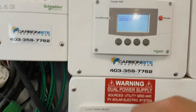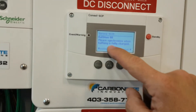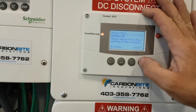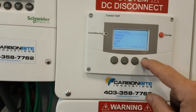The battery monitor is saying at the bottom 'synchronize now.' I can't synchronize it right now because when you disconnect the batteries and hook them back up it's just going to do it again. So if I go Enter it says 'please synchronize when battery is fully charged.' I'll have to tell you how to synchronize as we go along. Whenever you're working at this, always go Exit, Exit, Exit to get back to start.